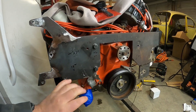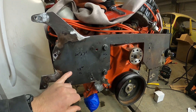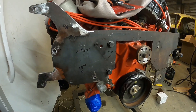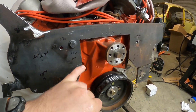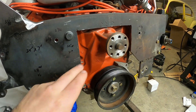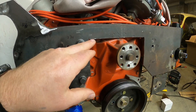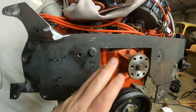This plate is 3/8-inch thick steel and it originally started life as a 24-inch wide by 7-inch tall piece of plate steel — that's what I had laying around. For my center cutout, I found center of the plate at 12 inches, and this gap right here is 7 inches wide. From the bottom edge going up I went up 5.5 inches, which should leave about an inch and a half up top.